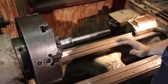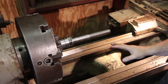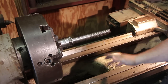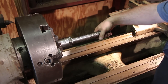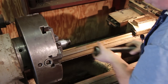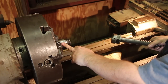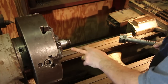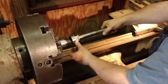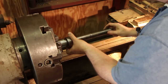Before we get into this, I was just thinking while I was off camera there, I probably need to make just a few more comments about the setup that I have here. For those that are regular subscribers to my channel, you probably recognize this setup. We actually turned this little arbor here to make the new arbor that I made. So this is just a stub arbor that we did. This is an exact copy of what's on the shaper. I've got this all indicated in, so it's running true in both this direction and on this face, because this comes in and seats on that face, that flat down there. And I know that this is running true on my lathe.